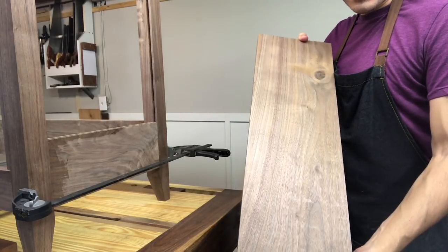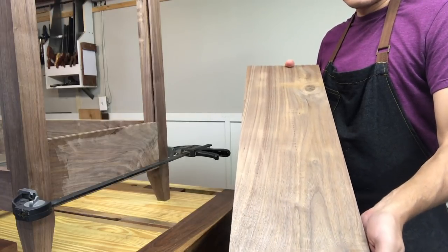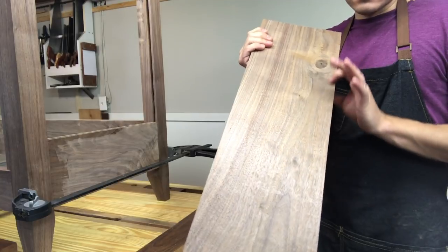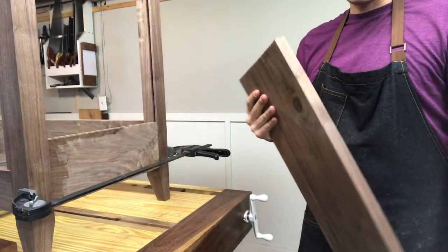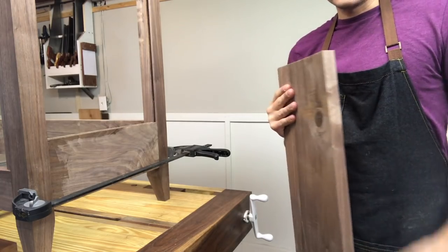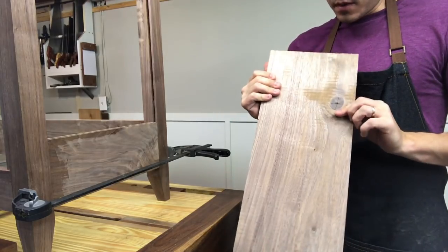I've got my section cut out here. This is going to be about an inch larger than I need it to be, so I have room to joint it and remove material from this side to get the exact seam I want. Now I'm just going to make a kerf around here, and then I'm going to go to resaw it. But this is going to be my board. It's going to be bookmatched this way. I'm excited about this.